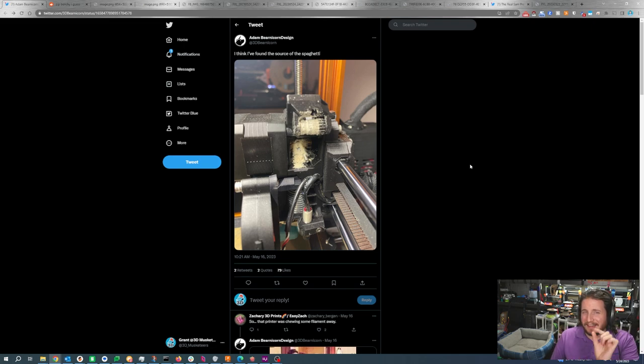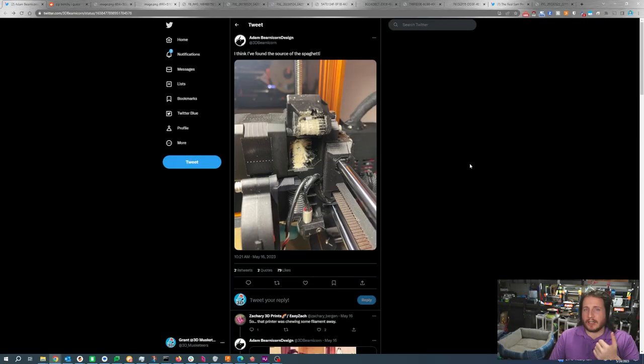Each printer is a little bit different, and if those hob gears don't line up properly — it is a dual drive where one gear drives the other — it can cause some issues in filament feeding as well. I would hedge my bet that it's either extruder pressure or the PTFE, because the PTFE does wear out on the hot end side. With the vertical 5015 visible, this might be an original MK3. If that's the case, while you're pulling the whole thing apart, you might want to look at printing the MK3S Plus upgrade, which gives you a better filament path and easier use for TPU and softer materials.